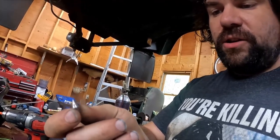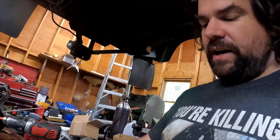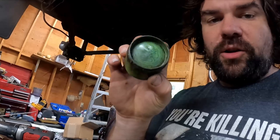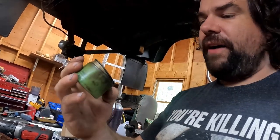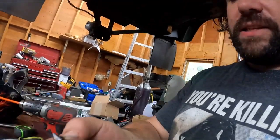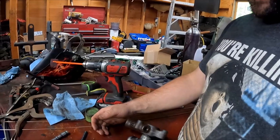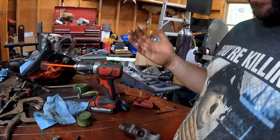And then there's a little gray ring on it that you'll see. That gray ring is because afterwards I took just a little bit of clover compound, fine solution, which is a lot like what you'd use for valve grinding compound, except it's oil-based instead of water-based. But it's good stuff. It's in every machine shop in the world. So I used that to polish this to the seat, just so if there was a little ridge on that device, it would still seal pretty well.